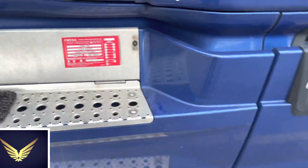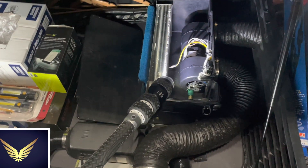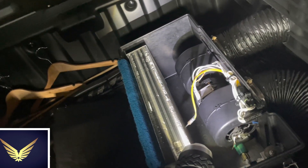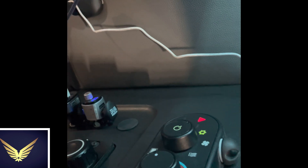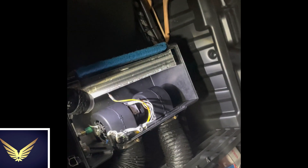I'm going to stop everything, tighten that loose screw, and then we'll see if it works. The APU keeps your TV, your fridge, your microwave - all the electrical compartments running when the truck engine is down. Before we come back to fixing it, it just shut down - now it's all red. That's probably because I had the cover of the APU box open, and that screw was loose.